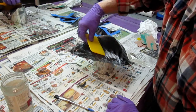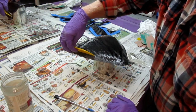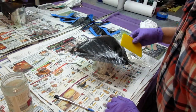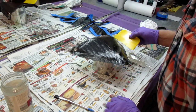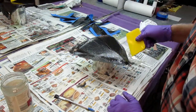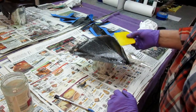Okay, so this is going to go on. I have no sense letting the camera run. I've got a crease there I've got to deal with, a crease here, and I'm just going to get as much of the resin troweled off as reasonable. But I don't want to dig in and disturb that weave if I possibly can.